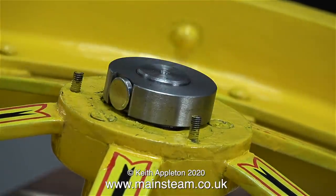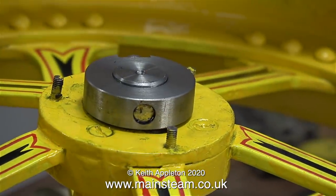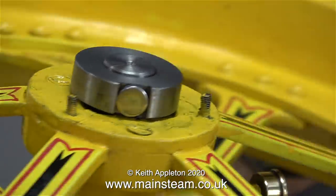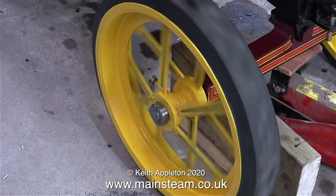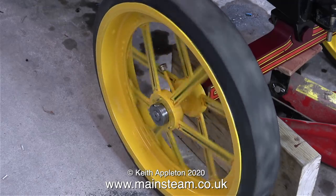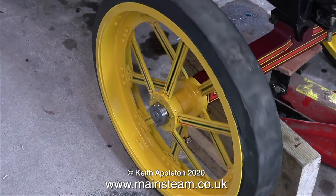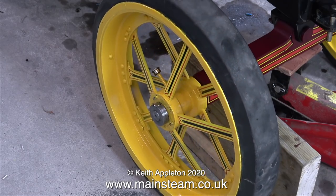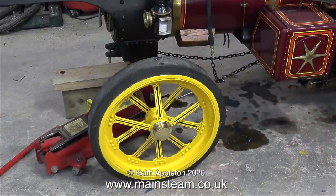It's quite satisfying pushing this pin into this collar through the stub axle. When I shortened the pin I think I shortened it just slightly too much, but it's still a good location. If I want to take the pin out, I just tap it out. After refitting the stub axle to the axle beam and tightening the Allen head bolt that stops the thread from coming loose, with the wheel in position I checked the end float — it's just a tiny bit to allow for any expansion of the hub. After a good application of grease, the repair is completed. Having a quick look at the wheel on the other side, I did notice that the stub axle was a tiny bit loose — I will look into that in the next episode.